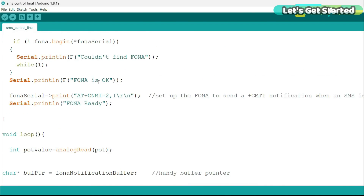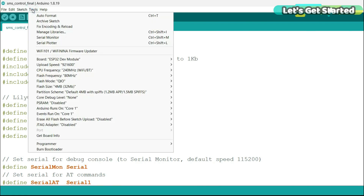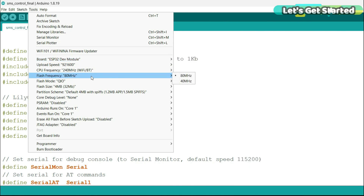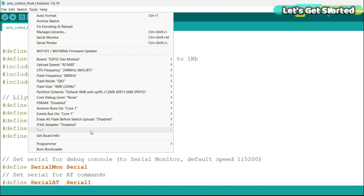The program is quite simple — with a little practice you will get the idea. After this, if you are using the ESP32 Wi-Fi plus Bluetooth model for the first time, you will need to install it in Arduino IDE. I have already installed it and have different ESP32 variants available. If you can't see ESP32, you will need to install the ESP32 board in Arduino IDE — I have already made a video on that. Once programming is complete, select the ESP32 dev module and the serial port, then upload the program.